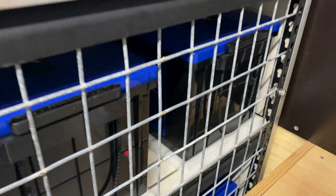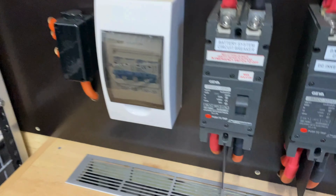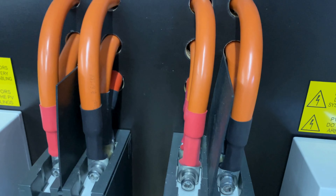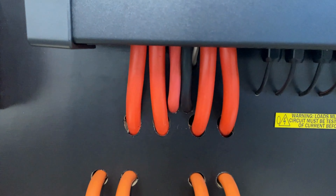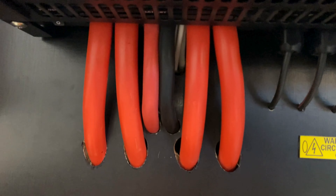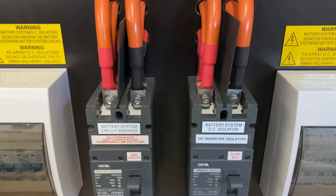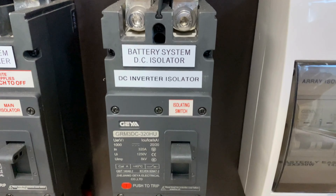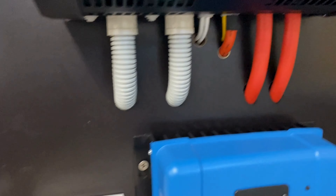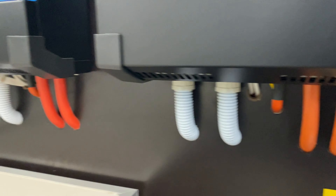From that breaker on the left, there are those three cables that pass from one breaker to the other, and also those cables that run up to the MPPT. The two smaller MPPTs connecting to that DC bus via their two circuit breakers, joining up on the 450-200. And once the power feeds over to the inverter isolator, we come out the bottom with those three 70mm cables, and one pair goes to each of the three Multi-Plus units.